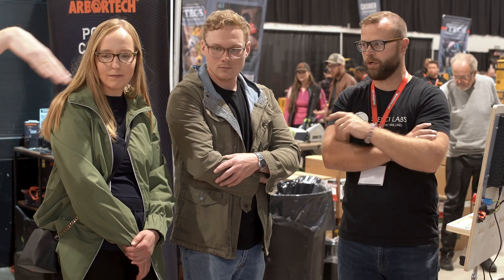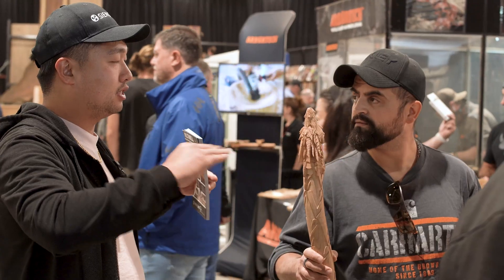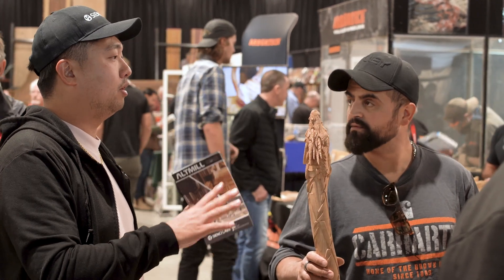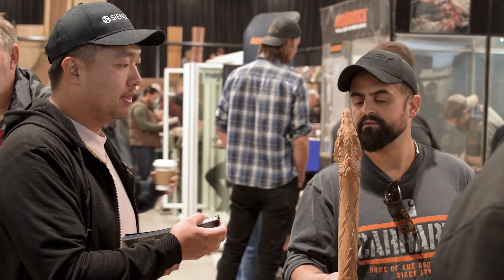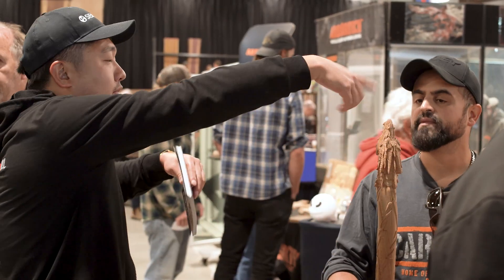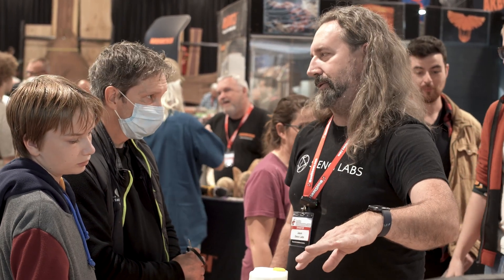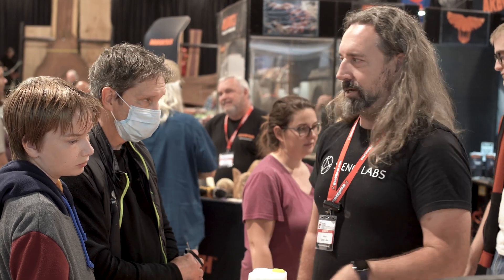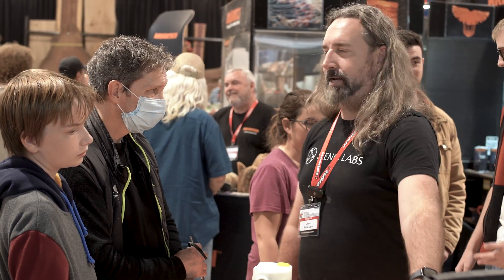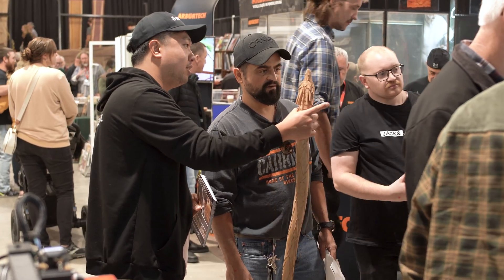That's a huge bonus quite honestly, especially carving that walking stick — I was hoping something didn't break. There's a surfacing process where you basically turn any shape into a cylinder, just to make it easier for the next part of the cut. The tool will rotate and go up and down to follow the contour of the dragon or whatever. On this one you get a manual dial — never use six, set it to dial three, turn it on, then hit go. Often what happens is you forgot to turn it on, hit go, and you send everything to the dirt. This one starts at $1,800 and the alt mill starts at $4,000. The rotary starts at $600.